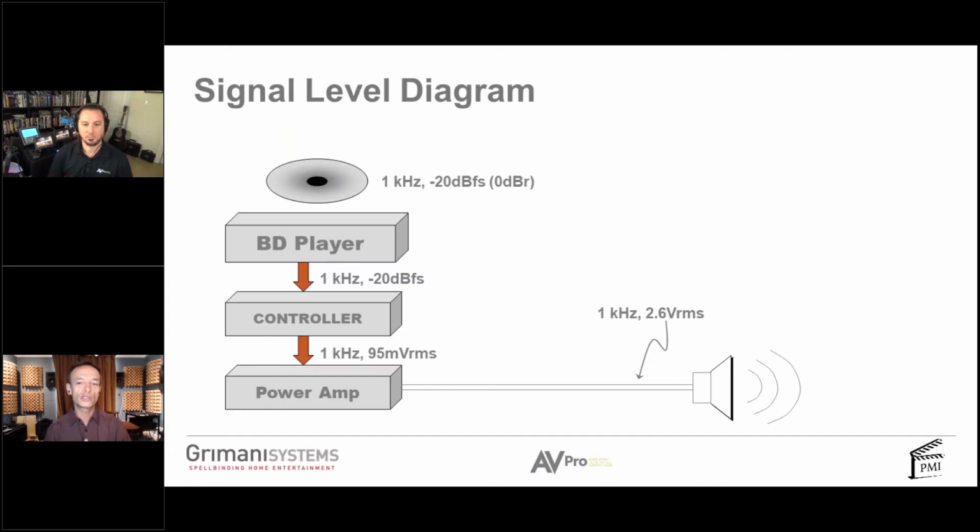If it's 4 volts, if it's 1 volt, whatever it is, it should be all the same coming out of all of the speakers, given the same input. And if one of them is wrong, you've got to go figure out what happened. Something's wrong somewhere. Don't compensate for that by turning up a level somewhere else, because you may be overloading something, you may be missing something.